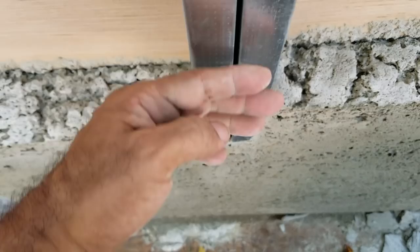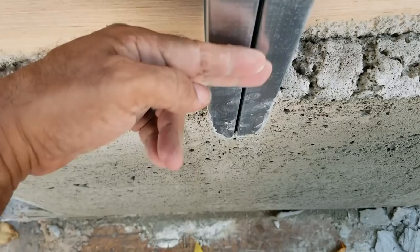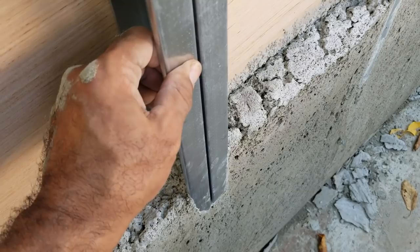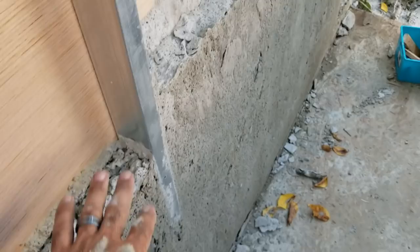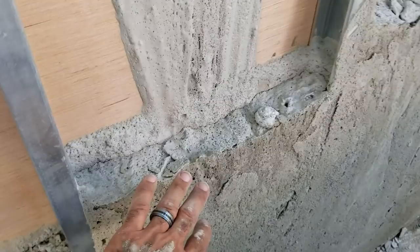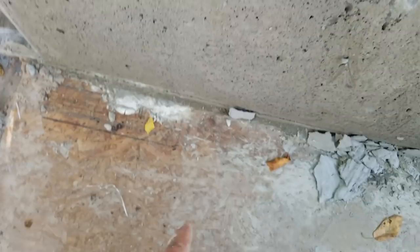When you fill the spacing with aircrete, you'll fill that one-inch gap and you'll have a nice aircrete wall that's up to code for structural use with two-by-four steel studs. But if you have a house right now or a barn and you need insulation, this can work because it will also make your wall space fireproof and bug proof.